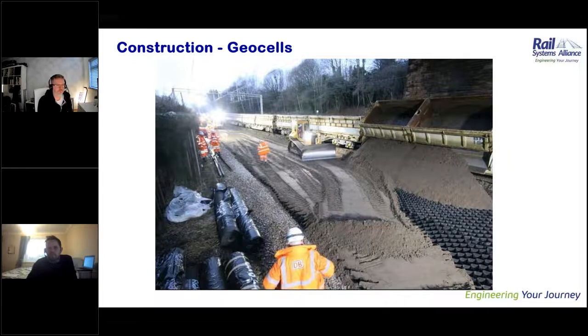The way the dozer operations happened was that the blade was filling the geocells as it went. So by the time the dozer went over the geocells, it was stable. That was the principle of it. At the very start, there's a vertical cut in the formation, and the geocells are placed against the vertical cut, so that when the guys come down, you can run right onto the top of it. There wasn't any other interface, so it worked quite well. Thanks, Willie.